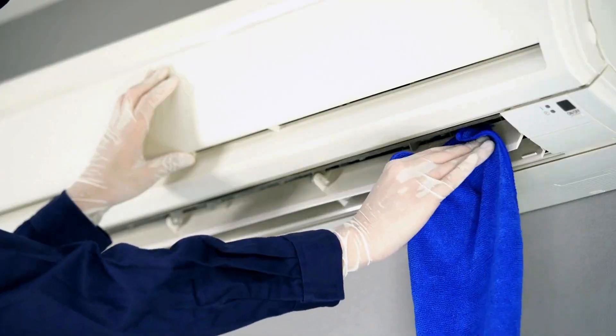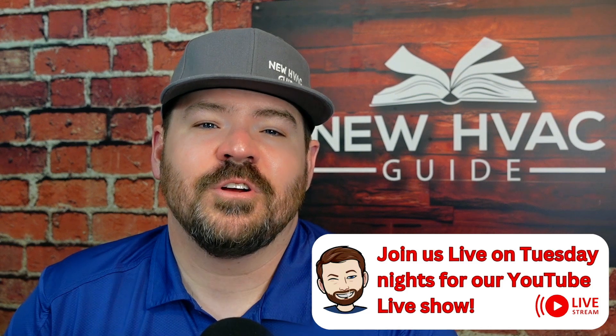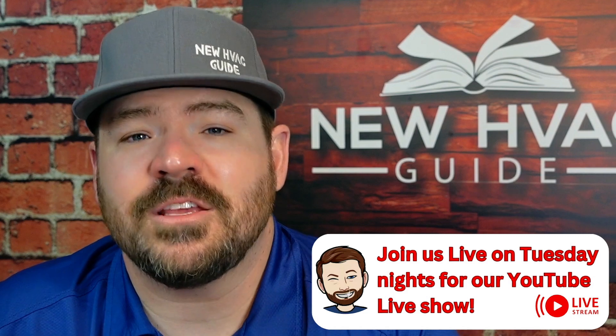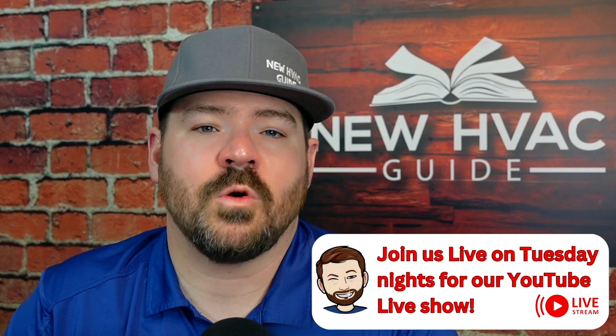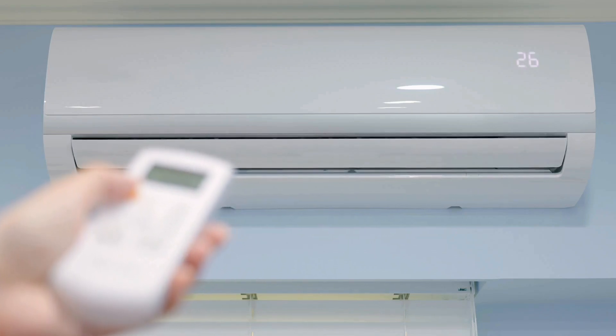So what do we do about all this? The first thing is that filter we already talked about — make sure that you're cleaning it religiously. It's not like that air filter in your conventional system that you're replacing. On these mini splits, I think you should be very religious about getting in there and cleaning that washable filter as often as possible. I've seen some get damaged and they're not filtering the air as well as they used to. You can get replacements for them. You may have to go through a contractor to get it, but it may be worth it.